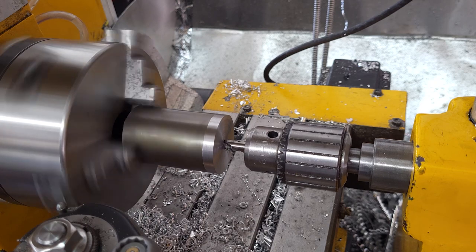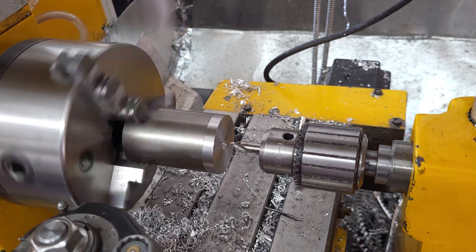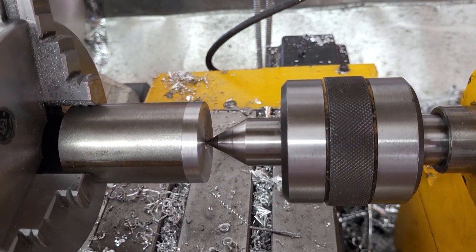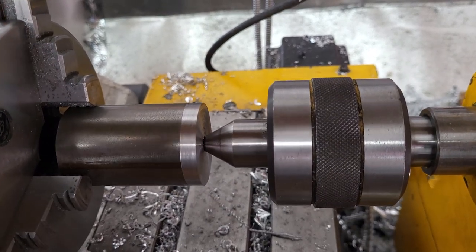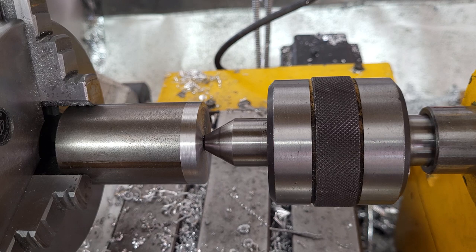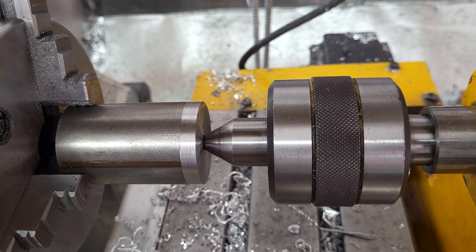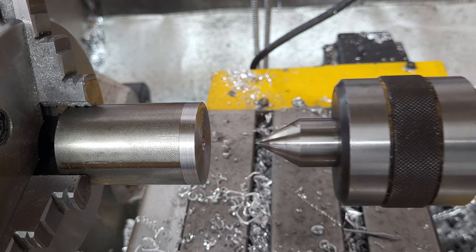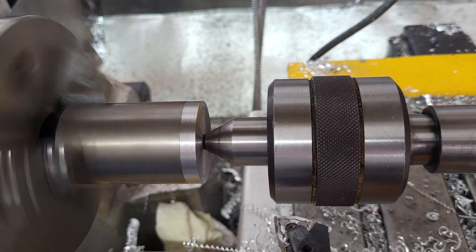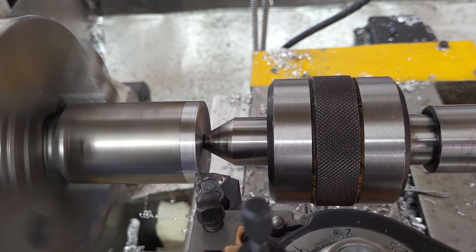I'm building a centre for tailstock support. The table hit the tailstock, which is too short for the live centre to reach the part and have the tool reach the part. So I need to move the live centre over onto the 4-inch extension, which makes it all bendy — the joys of a 3-in-1 machine.